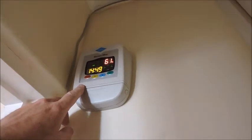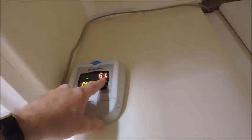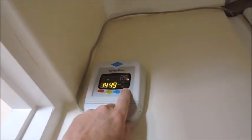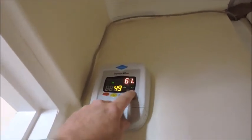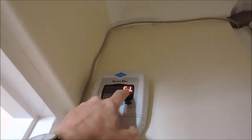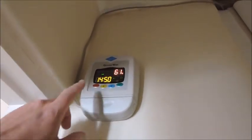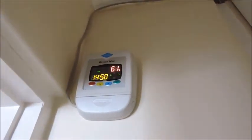This device is absolutely essential if you have solar hot water heating. It's a timer that shows you the thermostatic temperature of the middle of the hot water cylinder. You have a range of programs that allow you to choose when the device will actually come on, you can manually override, and you can preset the temperature at which the grid will click in. Currently I'm already 11 degrees above that. So basically, you can set it at 5:30 in the morning — if the temperature is below 50 it will click in and top up. Without this you'd just have a hot water tank full at the start of the day and the solar can't do anything. So even at the end of the day, after a couple of showers and even a bath, there's still surplus hot water which I want to utilize to preheat the washing machine and dishwasher.